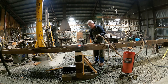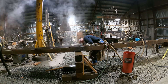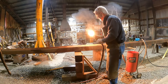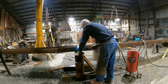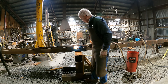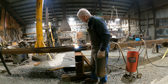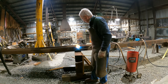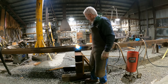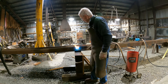I've seen guys that just use ambient air temperature to cool the steel, that might use a garden hose, or wet rags to suck the heat away from the spot they want to shrink. But a cooling gun radically increases the movement — it reduces the time and makes it more controllable. What I'm using is just a cheap sandblasting pot that didn't work at all as a sandblaster, but makes an excellent cooling gun. My air pressure is set around 100 psi and the venturi action out of the bottom of that pot creates a blast of water vapor that transfers the heat away in a hurry. I saw John Adolph do this in about 2006 at a Northwest Blacksmith Association conference in Kennewick, Washington. I was blown away, and every time I get a chance to try this for myself, I'm blown away again at the creativity and the talent and the ambition of that old man, and how he has helped so many people think and do new things.